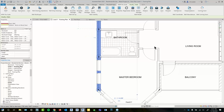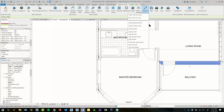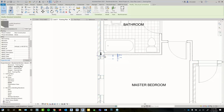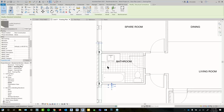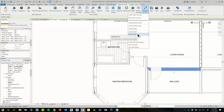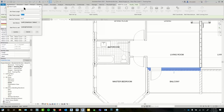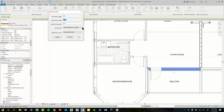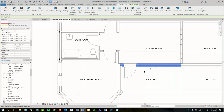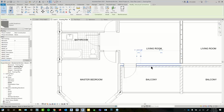So in the software, we use something called a marker. A marker is just a preloaded term that we use to preload information. And one of the markers that we have are these splits. So you can see I've already got a few thrown into my wall here. But this is another point of automation that we have where we've got these split tools. If you are in the prefab business, you can put in your maximum panel lengths, your minimums. You could even incorporate gap tolerances between the panels if you wanted to. And in this case, I just threw it in this wall over here, and it went ahead and threw in that split marker.